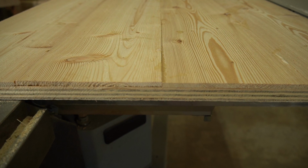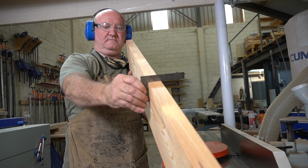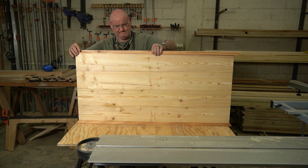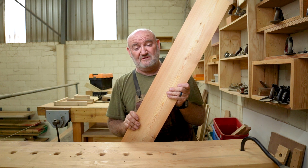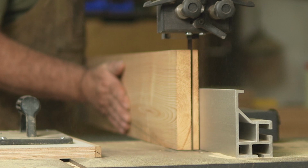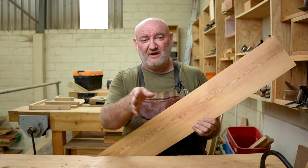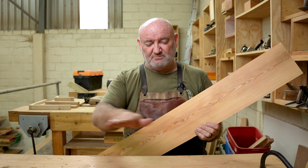We're going to put a plywood base and we're going to clad it with nice thick pieces of this wood to give it stability and strength. And we're going to put a nice solid trim around that to make our top absolutely beautiful and weatherproof, bulletproof, everything proof. What we're going to do is we're going to deep saw this. We're going to cut it in half and we're going to take it and what we're going to call, sometimes it's called book matching or butterflying. We're just going to butterfly it open or book match it open, and we're going to create a beautiful surface